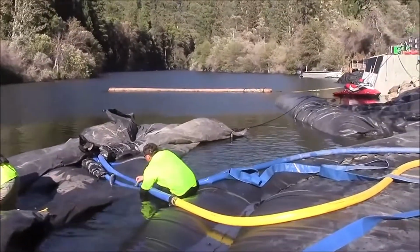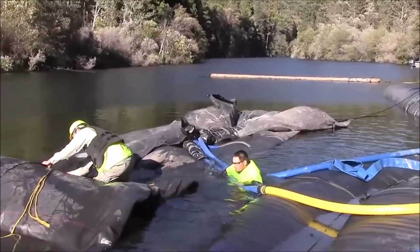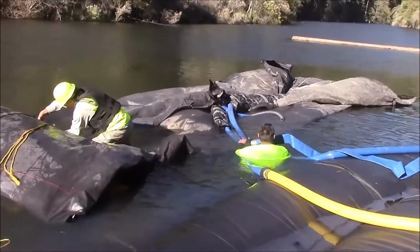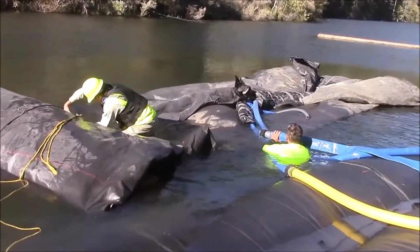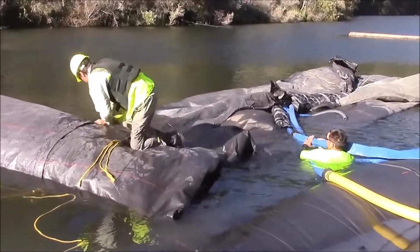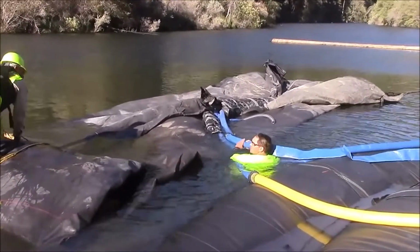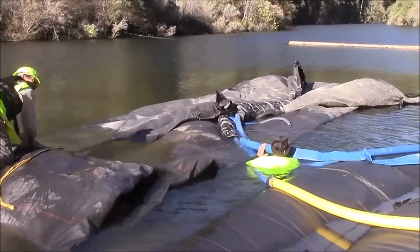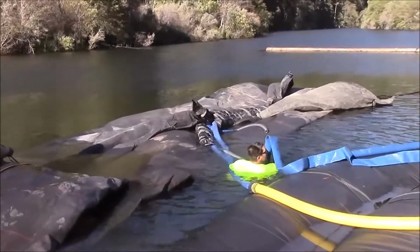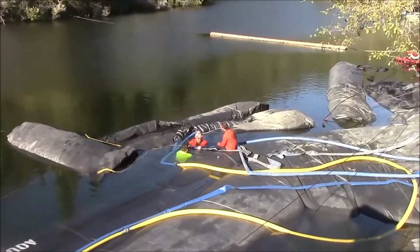The upper end, the upstream side, has been tied back, so it can't go anywhere. This 8-foot tall AquaDam will act either as a spacer in the work area or as the final backup dam for the primary 16-footer. So this will be installed first to give us aid and support during the installation of the 16-footer tomorrow. Continuing to fill the 8-foot tall AquaDam.